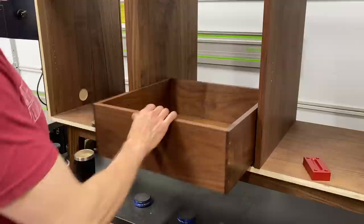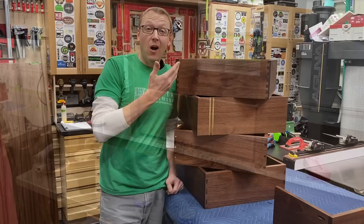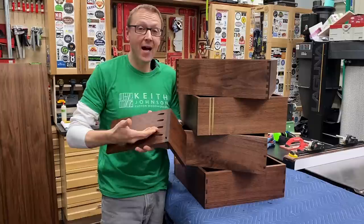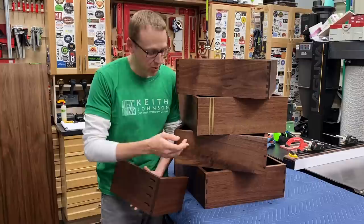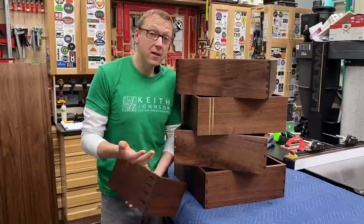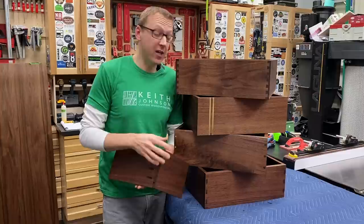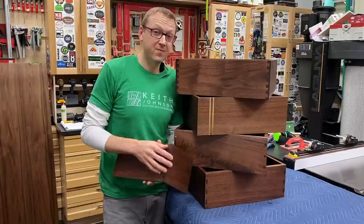So there are a few different ways to dress up your drawers, some easier than others. But the pocket hole method — tried and true. Glue, pocket screws, false front over it. It's tough to beat the speed of this method. But if you're looking for something a little bit different, something when you open that drawer has a visual interest like the brass bars or the brass pins, hopefully this video gave you a couple of things to try — and also a couple of things to avoid. Thanks so much for watching and be sure to check out the next video, which will integrate three of these drawers into the walnut credenza and show you how taking a little extra time to add those extra details really can bring your furniture up to the next level. We'll see you next time.